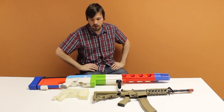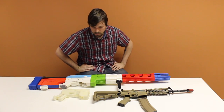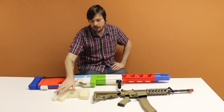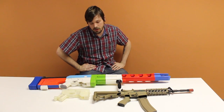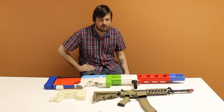With regards to printing it, the longest piece to print is the lower receiver. This is purely because I printed it at 75% infill, which allows it to be a lot stronger. It needs to be very strong around the joints where the motor is, as the spring pushes back against it in that direction, which could possibly snap it. It's the only area that undergoes the most stress with the gun. It took a total of 125 hours to print, which is five days.